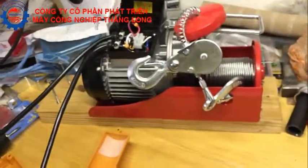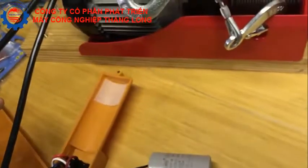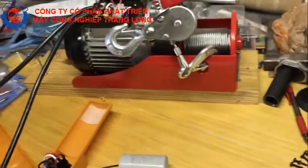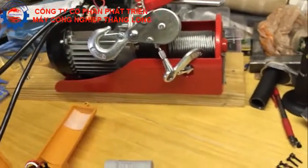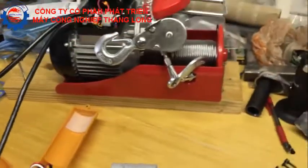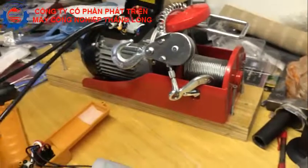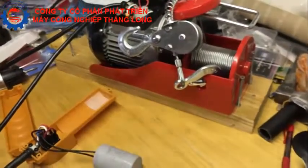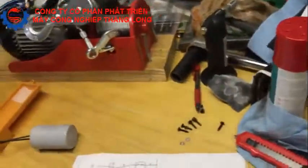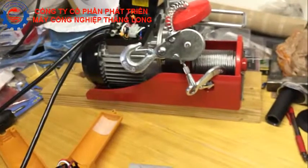I haven't seen anybody else showing how to extend this, but if you can do basic wiring you know what to do — just take pictures and swap it out. Make sure you get the right cord. I used SJEOW; if you get non-J that's fine, it'll just cost a bit more. I went with the elastomer version — more flexible. The thermoplastic T variant that comes with it is not rated for oil exposure, so if you're in a garage with oil on your hands, consider that. Hopefully this helps somebody out.